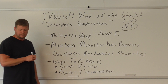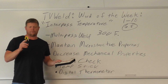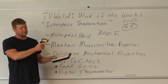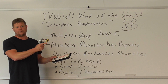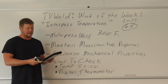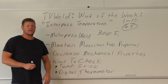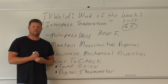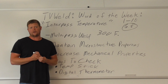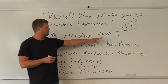Ways to check — it's pretty simple. This is the old school way: temp sticks. And now everybody has these digital thermometers — you just pull the trigger. It's reading 77 degrees in here; it's summer, beginning of August, that's probably about right. What I'm going to do now is draw a mock joint, put passes in, and as I draw them I'll tell you when you would do an interpass temperature check. Then at the end I'll find a welding procedure specification that shows where that 300-degree requirement is.